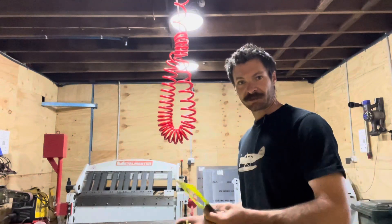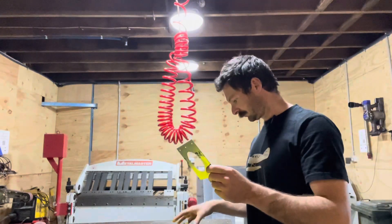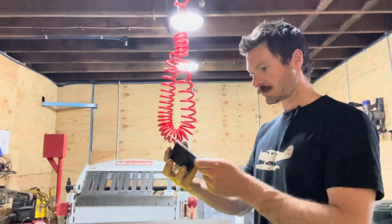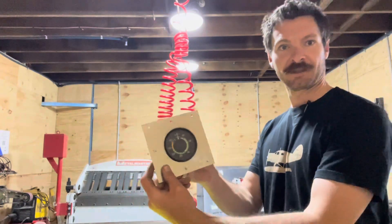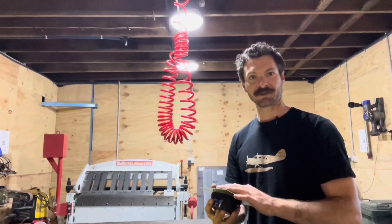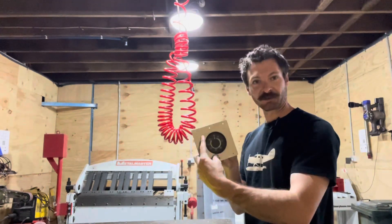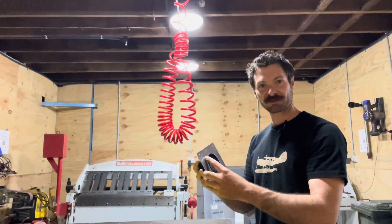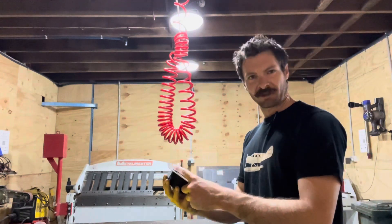So I've just had a bit of a test chop on a bit of scrap aluminium — the 3-1/8 inch hole that the instruments take — just to make sure it all works. Got an instrument in there, and I think we've had moderate success. How cool is that? Perfect fit. Who'd have thought that the size on the cutting tool would be the size it says it is! So now I'm going to get a bigger sheet and mock up the whole panel, cut some holes just like that, so I can mock all the instruments up, make sure they're in the right spots, and make sure the panel's the identical size.